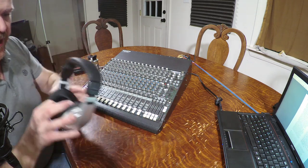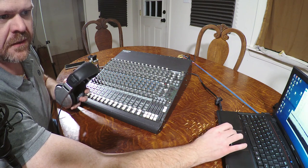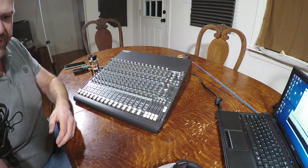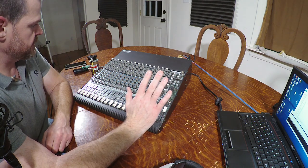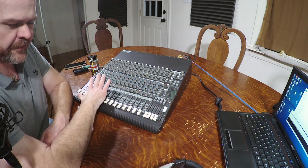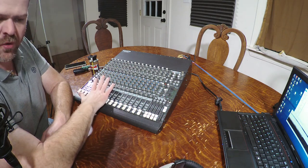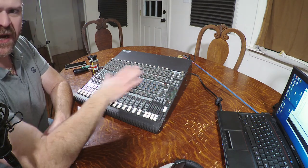I have to put my headphones on so I can hear it with you. I have a music track looping, which I want you to hear what's going on. I apologize for the crappy headphones, my good Sennheisers are at work. When you clean out a console, you're not just clearing out all the crap, you're also clearing out the lubricants and what helps the contacts work. So once that all got washed out, I started using it and I've started having a lot of issues.